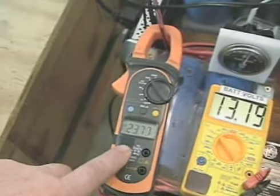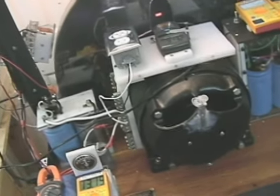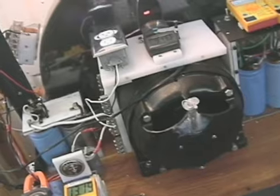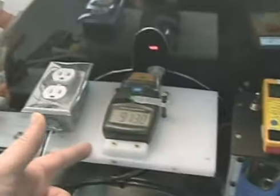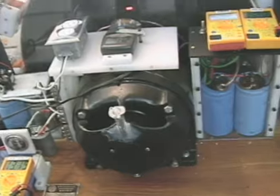This amperage level increases the faster the wheel goes. If the wheel's going 1,000 RPM and there are 22 magnets on the wheel, that's 22,000 triggers happening within the span of a minute. I really believe what I need to do is reduce the number of magnets and set them farther apart to help increase the speed, because it pretty much maxes out right here. I think there are limitations to how fast this can trigger and collapse before the next magnet comes around, so with 22 magnets on the wheel I'm just getting too many triggers.